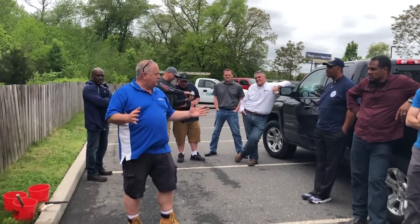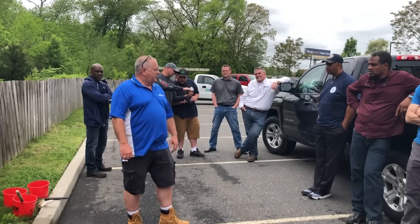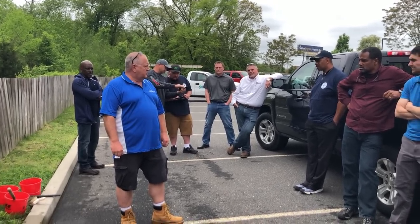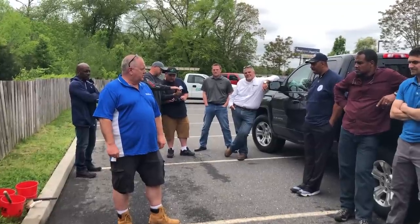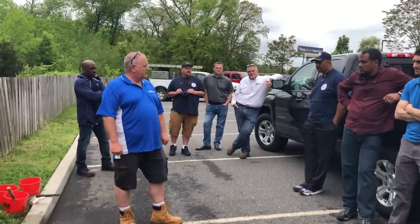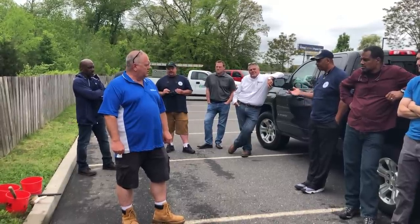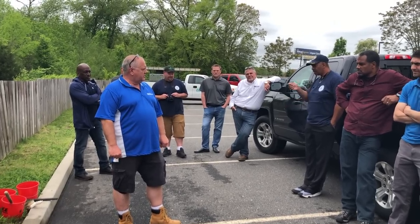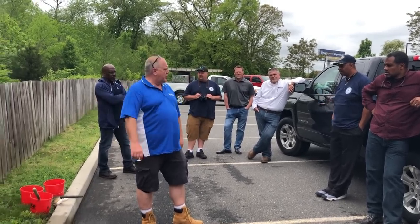That'd be the only difference. Still patience. No matter what, the first thing is wet it down first. Then pretty much strip it. If it's going to be that, strip it, put it on at dwell time, whatever amount is, 35, 45 minutes. Then you come with the oxalic afterwards, or do you rinse and then come with that? Just like that, oxalic while it's still wet.